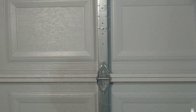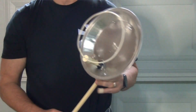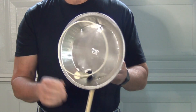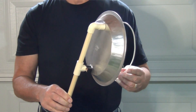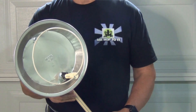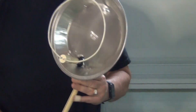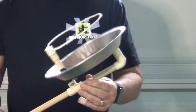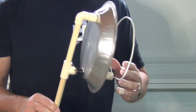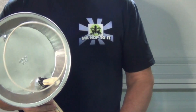The fifth antenna is the Pi-Pan reflector. Many people thought this wasn't a serious design, but it actually works very well. The aluminum Pi-Pan acts as a reflector, increasing the gain, range, and focus of the antenna. The element is 10-gauge copper and the body is constructed from half-inch PVC. This antenna does receive signals from a fairly wide direction, but the primary focus is pretty concentrated. Due to the wind resistance of the Pi-Pan, I only recommend this antenna for indoor or attic use. Making this antenna is a bit more involved.